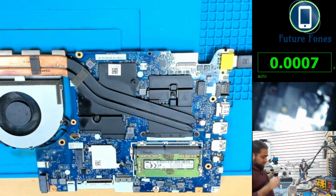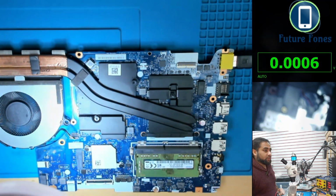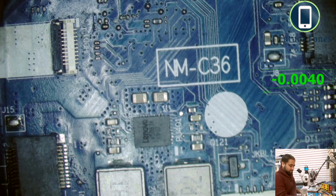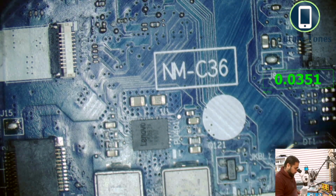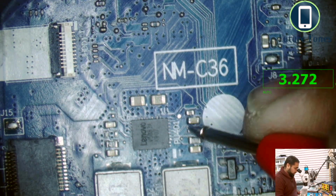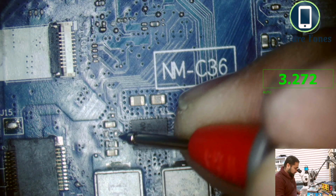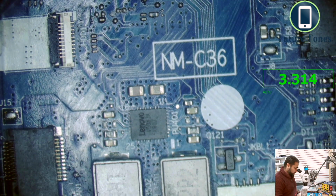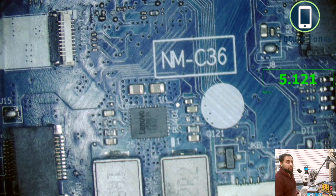One more thing we can check is the 3-volt LDO. Let's go back to the microscope. So the microscope is on, and we'll give the power, and we will check if we have a 3-volt LDO available now. The fan is spinning. This is our 3-volt LDO. Before, this line was short and we were receiving 2.7. This is our 5-volt LDO, which is also available. This is regulated power 3.3 volt, which is available now, and 5-volt regulated power is also available.